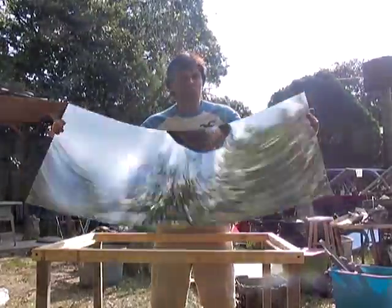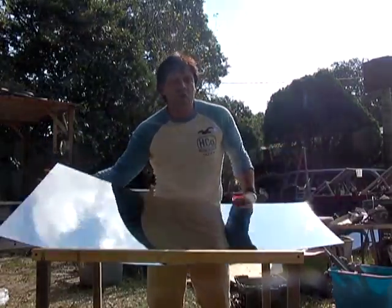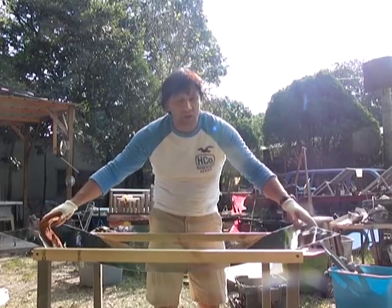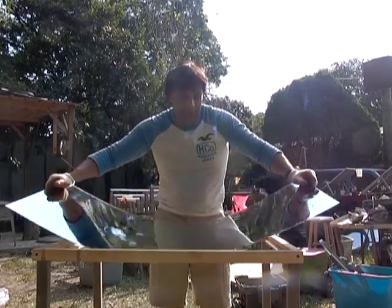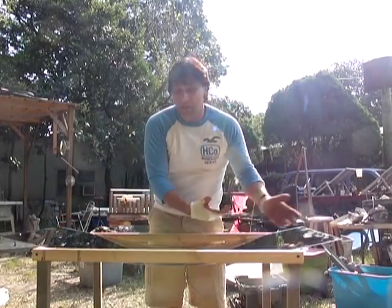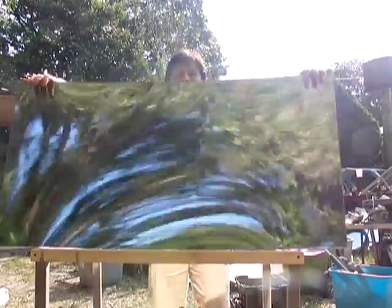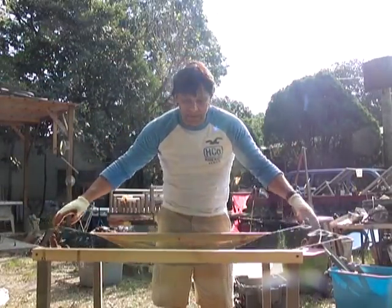This is flexible, so you can use it perfectly for a trough mirror. What I'm going to do in this video is show you a really simple way to make a parabolic shape with a flexible mirror. You can use the acrylic mirror for this, but this stuff will scratch up. You can see that it is a very nice, true reflective surface — it's above 90%.